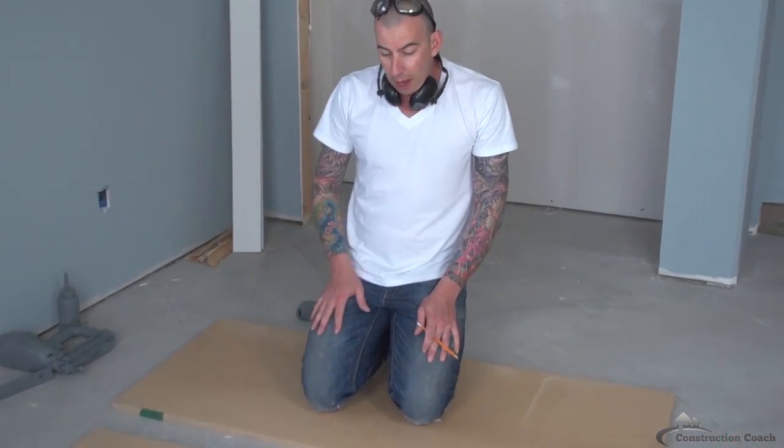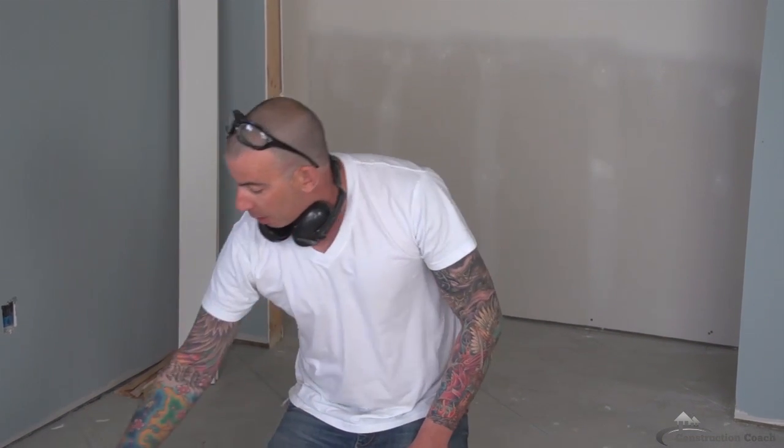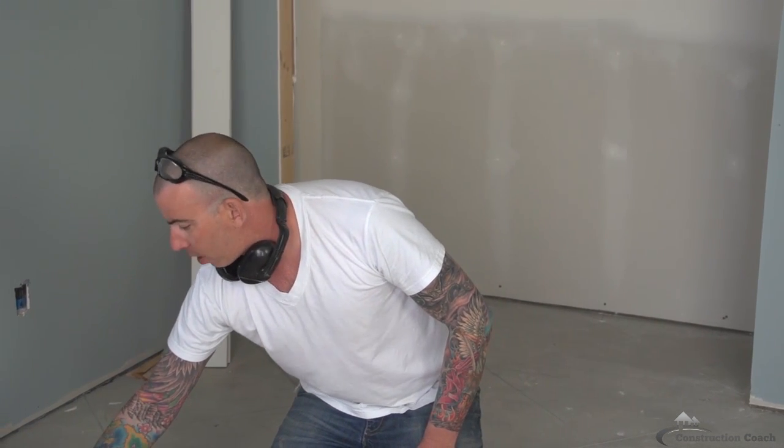Okay, so now I've got my center lines marked. I'm going to put a bead of glue down each edge of the top and bottom piece, bring in my side pieces, and just shoot some brad nails down this line and down this line to attach the square box. Then I'll glue up the center line and drop the center gable in and nail it in as well.